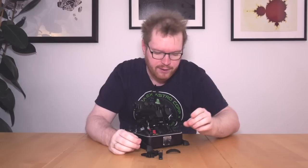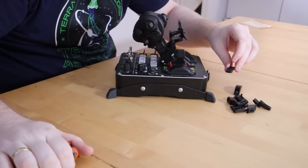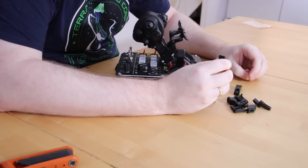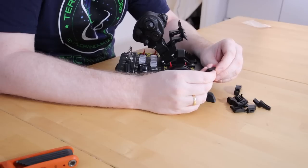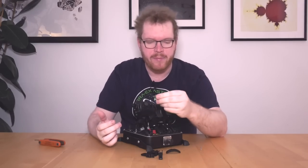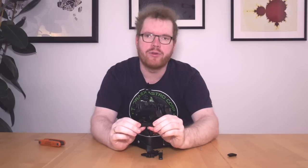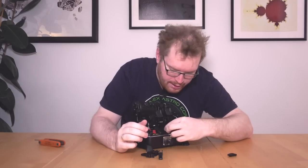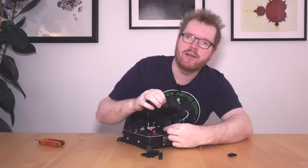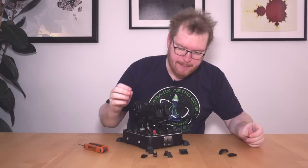There's a whole host of other different pieces, so let's run through them. I'll unscrew this one — the screw comes loose and you take the whole piece off. Be careful not to lose the screw. The piece I have here is the one with a little notch, and there are arrows on it to indicate which way the rollers and ball bearings should hit it. You can actually put one at both the top and the bottom — two pieces fitted at the same time. This is the one that was just on, where the ball bearings fall into the notch to indicate a certain position. It also comes in a centered variant; if you want the notch towards the center, you put that in and then you have a notch right at the center — it's a little more pronounced and falls into place.